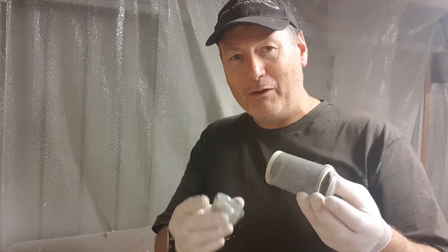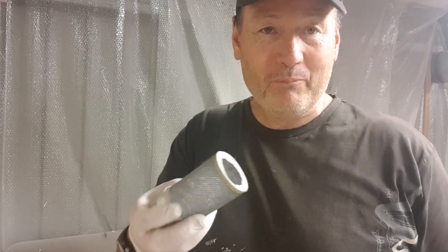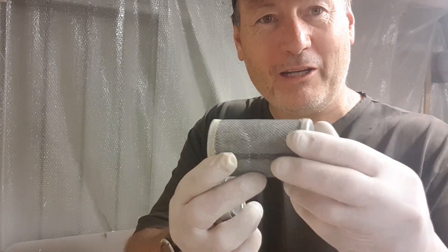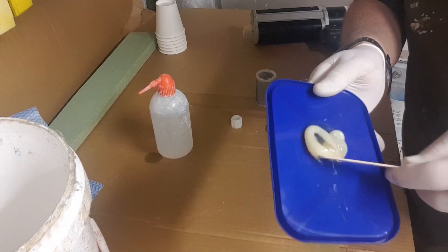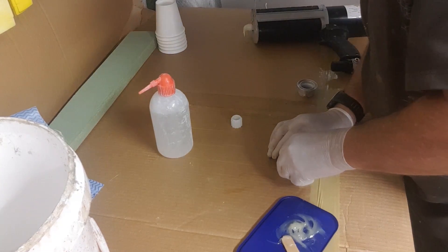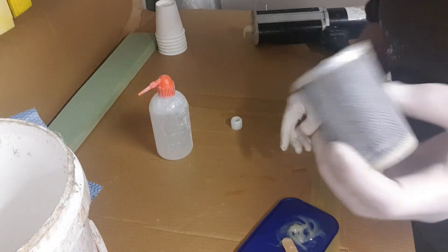Leaving it to sit in acetone, although it cleans it, is probably not the best method. It's 12 months old so I've been pretty lucky it hasn't come off, but if that had come off mid-spray there's a good chance I'd suck up a piece of coagulated gel or dust into my machine and could potentially do some damage. So I've given it a good sand, I'm going to use some methacryl and glue it back together, leave it out in the sun, and hopefully in about two hours I'll be able to get onto it.